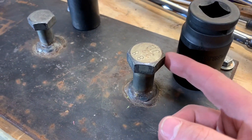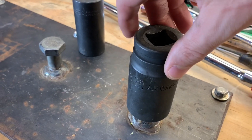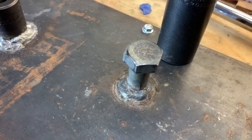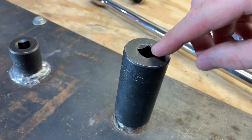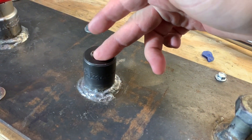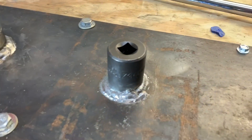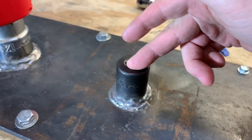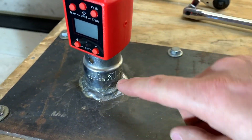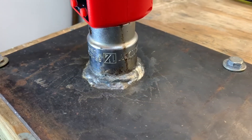So before we wrap everything up here, the old way that we were using this was a 32 millimeter bolt just welded down. We put that impact socket on there and you can see there's a little bit of movement. The other fastener — the 28 millimeter — had a lot less play in it. But now we're going to take all of that out because we are going to go right down directly from the torque adapter into a socket. Here we can see we got the Stanley 24 millimeter USA impact socket — that's going to be for our digital torque meter by Quinn from Harbor Freight. And then for our three-quarter inch torque meter, we have the one and one-quarter Stanley USA made socket.